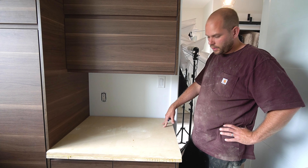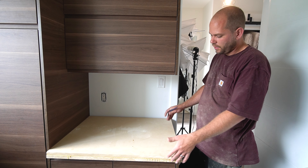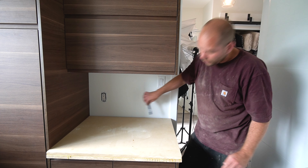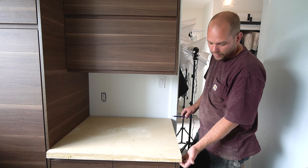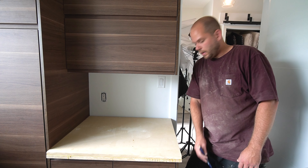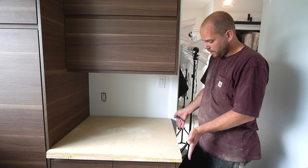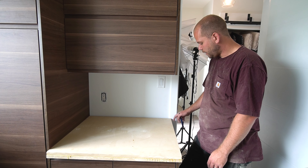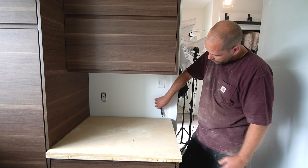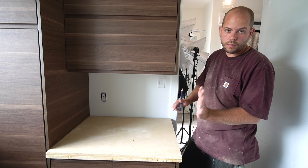So the countertop — we're just trying to fit it. I do it this way because if your wall isn't square to the cupboard, even if you cut it as a square slab, walls can have a slight bow to them, then you can scribe it. I only want about an eighth of an inch overhang on this edge, so I'll scribe this line here and add an eighth of an inch to it in the shop. That should give me this depth — I'll cut it out and it should slide tight to the wall. Then once we get it to slide tight, make sure the line is good, and if that's good we can cut the front off and we'll have a perfect fit.